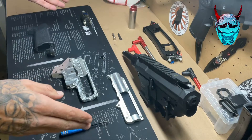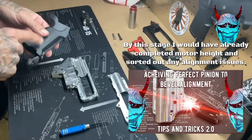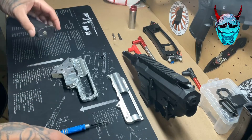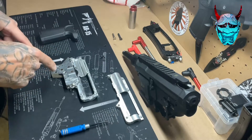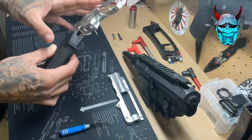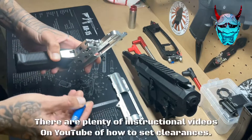That was the old way I used to do it. Now what I do to speed it up a little bit — I do not attach the grip to the gearbox with screws. This is just basic testing of clearances. All I do is take the grip, take the motor, just drop the motor into the grip, drop the base plate on. The bevel gear already has the correct amount of shims — all I'm doing is making sure the clearances between the pinion and the bevel gear are satisfactory. I've already set the motor height. I just drop that onto the gearbox, push them together, applying pressure from both directions, and then I take my little screwdriver or whatever tool I'm using.